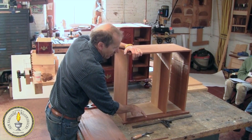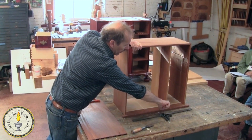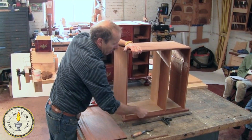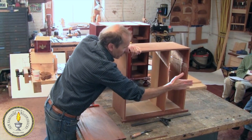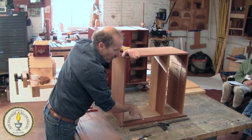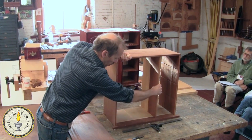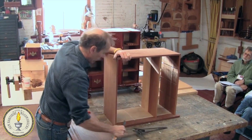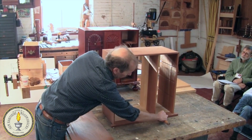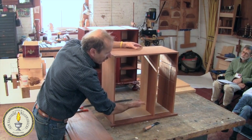I don't want to run my dado all the way out, because if I run my dado all the way out and slide this all the way out, it's going to be a little hole where I'll cut my molding away. So I want my dado to stop short of the furthest projection on this piece. I pull it out — let's say I've got my dado stopped about a half an inch before here. I mark just against my board here; I'm going to have to cut the bottom of this off so it can continue to slide forward.